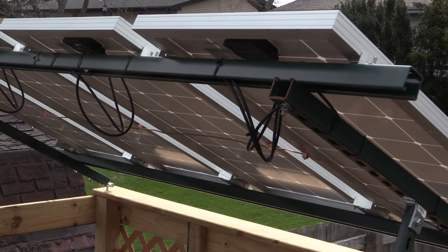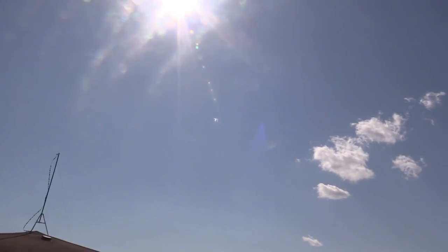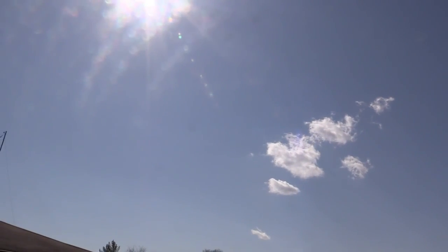When picking a spot to locate your panels, you have to consider that the sun will be lower towards the horizon in the winter and closer to directly overhead in the summer. While later in the video, I'll suggest that you need to tilt your panels as well. For now, know that you must locate a spot that will be in full sun throughout the year. How do you know where the sun will be in your location? There's a link to a calculator down below in the description. In my case, up north, the sun dips to just 24 degrees above the horizon in the dead of winter, but it rises to 72 degrees above the horizon in the middle of summer.